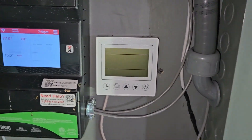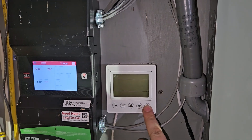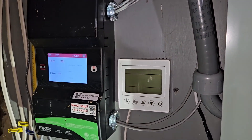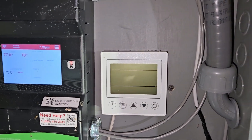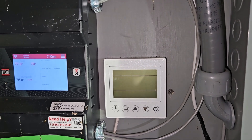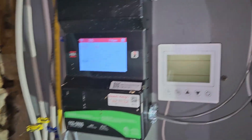According to the manual, what should happen is I'll turn power on at the breaker, then turn the power button on here, and my circulator pump should start immediately, and then the heat pump should start a bit after that. The system's full of water, so we'll just see what happens.